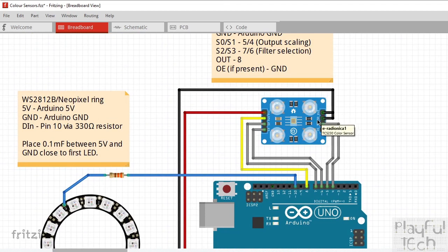On this board we've also got an output enable pin, the OE pin. When this pin is pulled low to ground, the sensor is on; if it has a high signal written to it, the sensor is off. In my case I've got it tied to the same ground line, so my sensor is always going to be on, and there's normally no reason why you wouldn't want that. You might even find your board doesn't have an OE pin — it may be permanently soldered to ground. But if you were running a battery-powered project, you could wire this OE pin to a spare GPIO pin on your Arduino and write a high signal to turn the sensor off and a low signal to turn it on again.